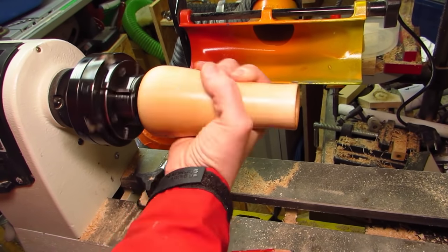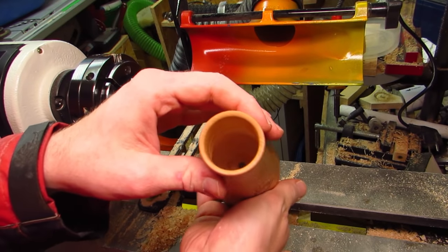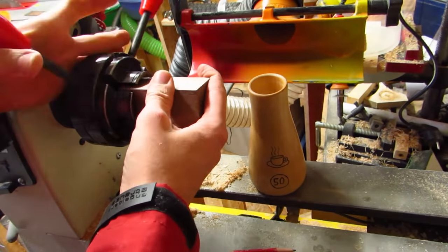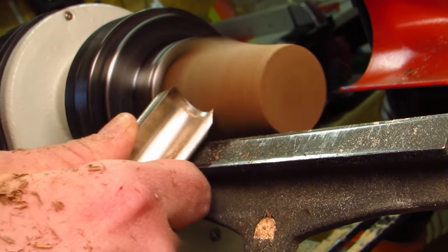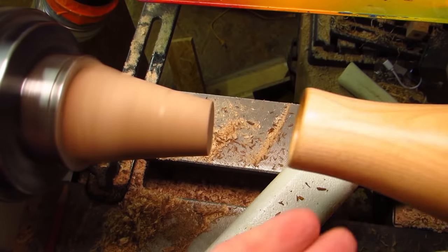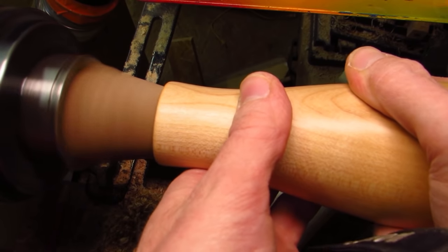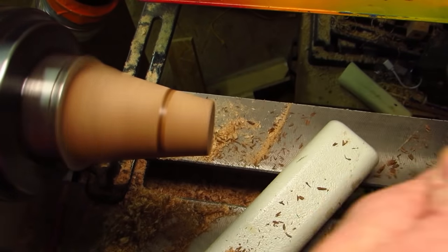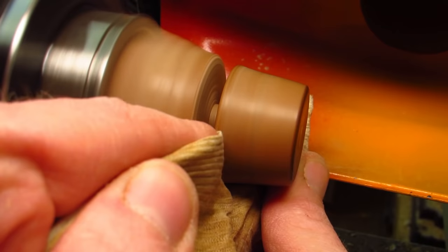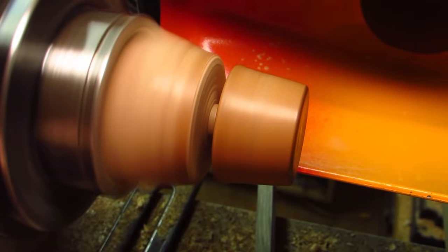But it is not a piggy bank yet. It is not even a good turning because I left the inside raw, but then again the coins won't mind and I was in a hurry. For the plug I chucked up a piece of walnut, turned it plug-like and tested the fit. By testing the fit I mean I held the flask against it to see where I got burn marks. This lacks style but gives me a good idea where I need to remove a little more. After finishing the plug with wax as well, I part it off and head over to the drill press.